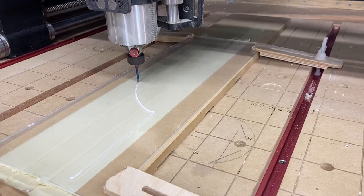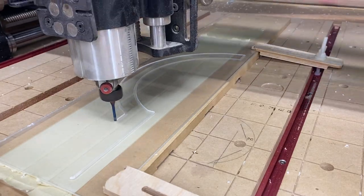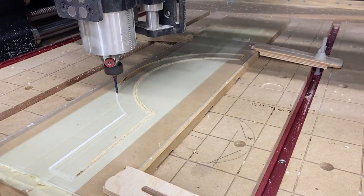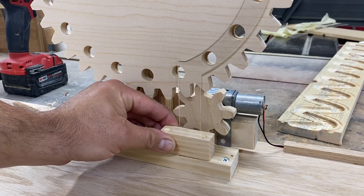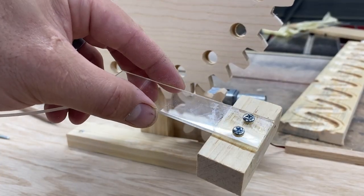What I'm cutting here is the marble guide out of acrylic for the large wheel. This is critical to hold marbles in place — just like I showed in the test, when it gets to about halfway up, maybe 60 degrees, those marbles are going to want to fall out. So whether you make this out of acrylic or wood, you want to make sure all the holes are covered.